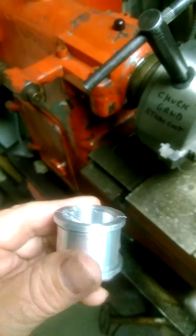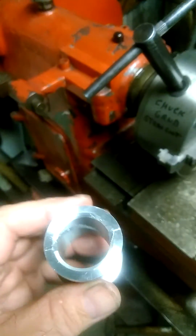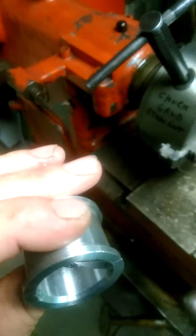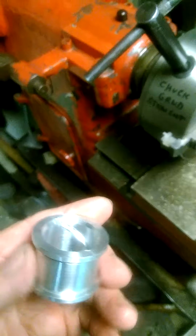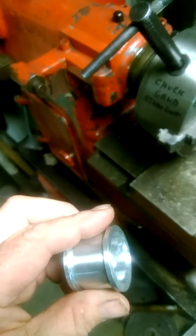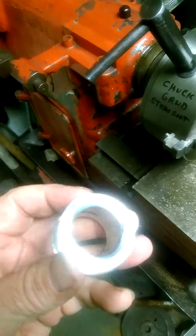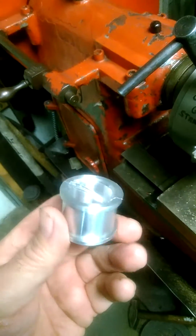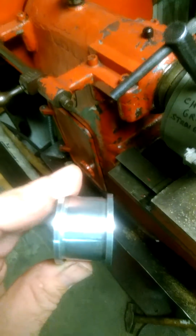So even though this is a non-pressurized motor, that dipper, rotating at a couple of thousand RPM, is actually force-feeding oil through that hole up into the bearing. And the counter-rotation of the crankshaft in those grooves creates a pretty good coating of oil. So in one way it's primitive, in another way it's a pretty cool system.